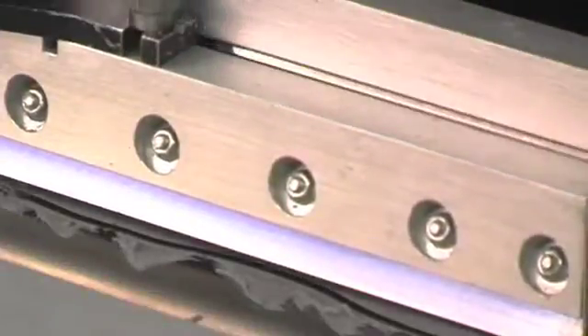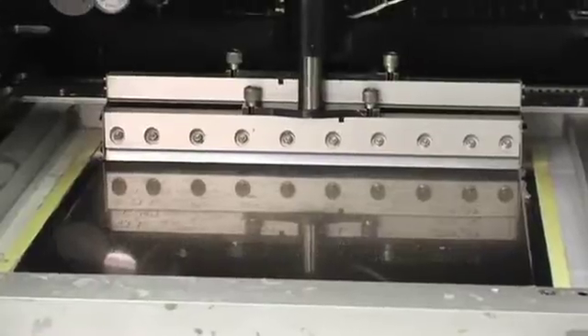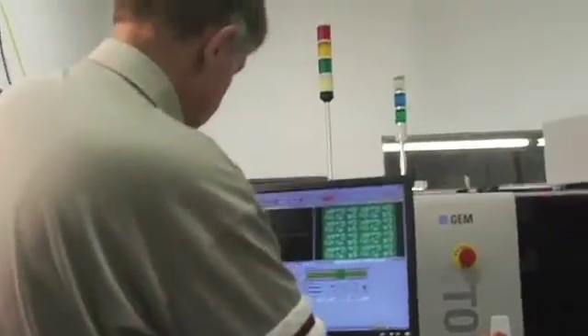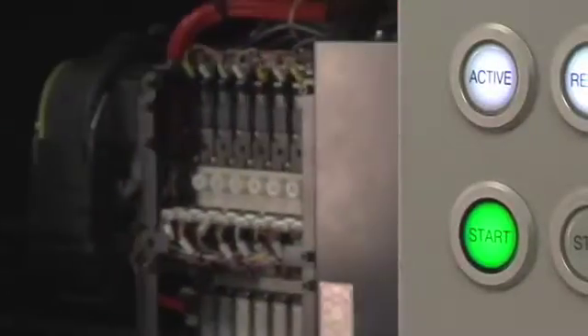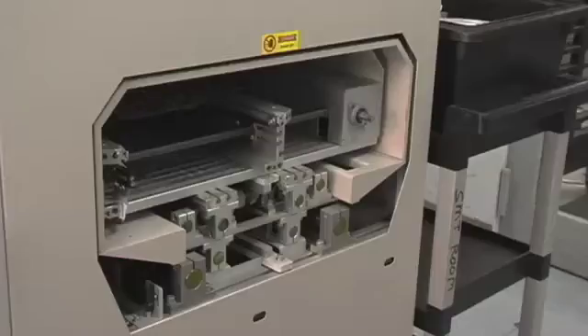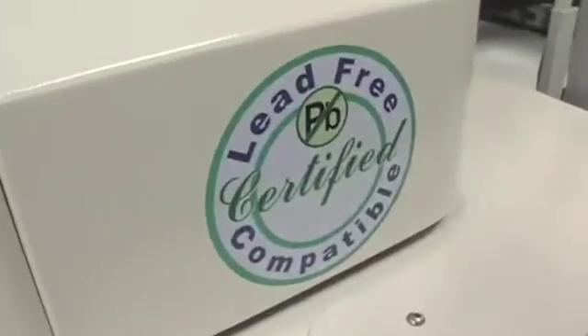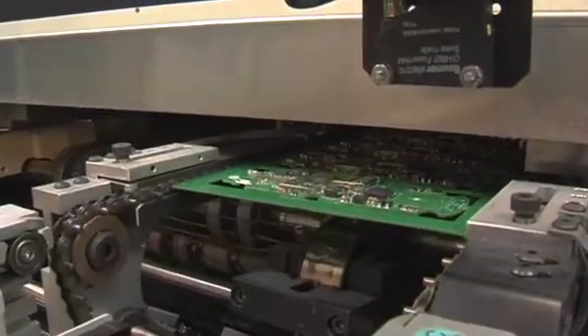In the SMT room we place the paste solder on the boards with a stainless steel screen that gets vacuumed down to the PCBs, and then we go to a quality assurance step where we have an optical scanner that looks at the paste and makes sure that it's the right volume, the right placement, the right size. Then we run them through an oven that allows us to use a lead-free solder. We don't have to invest in lead-free, but that's something we just feel is the right thing to do.